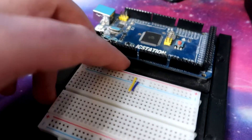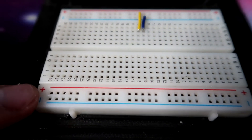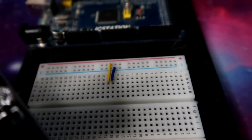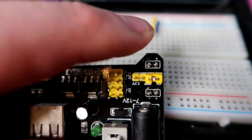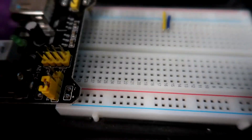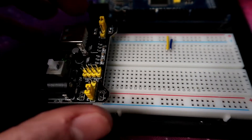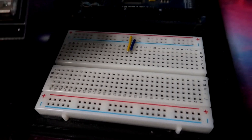We're going to jump across to the actual unit and the breadboard. You can see the rails — positive and negative on both sides. You want to make sure that when you're attaching these power supplies you get it lined up properly. You can see the plus and minus marked on there. If you put it the wrong way you'll actually reverse the plus and minus, which is not what you want — you'll fry some stuff.